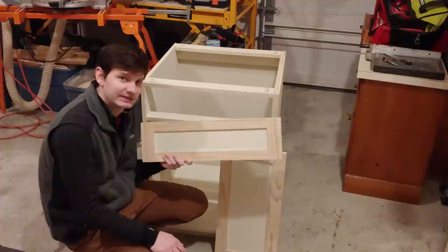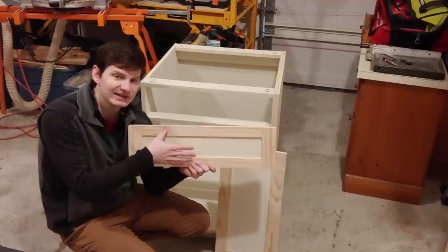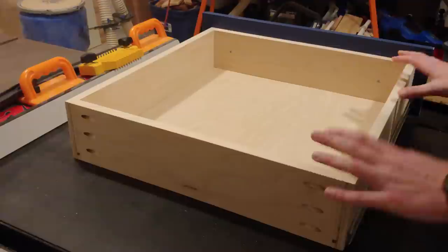With all our doors made, I went ahead and made drawer faces too. This drawer face is made pretty much just like the door. The only difference is the rails are thinner than the stiles. The general rule I found is that if the drawer face is seven inches or less in height, you want to make the rails thinner — I made my rails one and 5/8 inches thick. If your drawer face is five inches or less, then you want to make a solid slab.